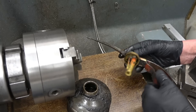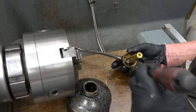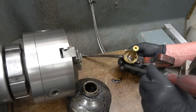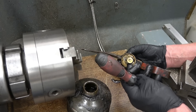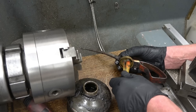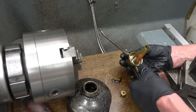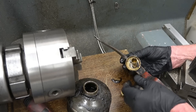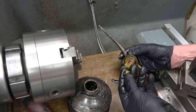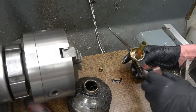You can see inside it's all brass, no plastic. The seal on the top is badly deteriorated — it's all come to bits. Chances are a little bit of that is trapped in the one-way valve in there. That should screw off, which it does. There's a little bit of that black muck in there. There's a piston in there — when the piston comes down it pushes the oil up through that spout. And there's a little one-way valve with bits of muck in there. A good clean-up and wash-out — there's nothing to go wrong with it.